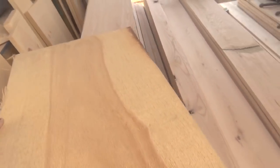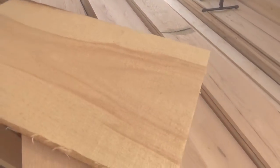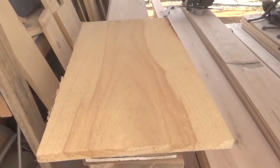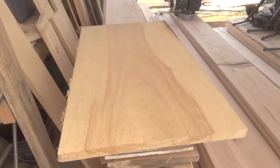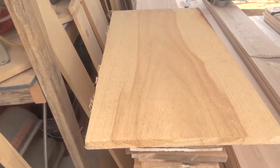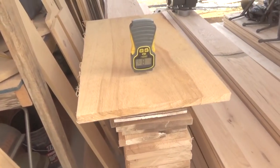But it wasn't always like that. When I first cut this board out, I liked the width of it and it was nice and straight. But what I want you to notice is the grain is pretty uniform through here — it's pretty straight grain. But it's not a quarter-sawn cut either; this is slab sawn. You see the grain pattern there? So you would expect this to warp pretty hard, cup up in this direction. By putting a little bit of water on one side — I was spraying it with a hand sprayer like a Windex bottle — I sprayed water on it and I managed to bring it back from being cupped to straight.